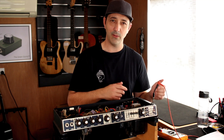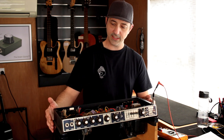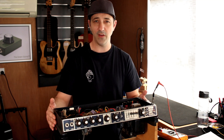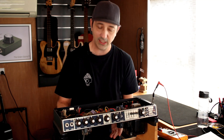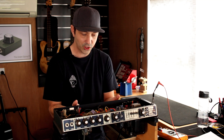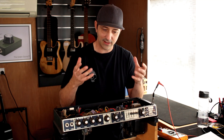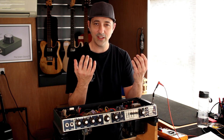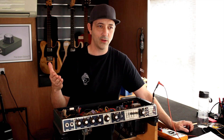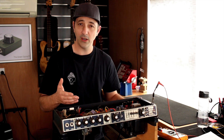You also want a clutter-free work area and something stable to rest your amp on. This is an amp chassis cradle that I made about 10 years ago — I've put hundreds of amps on it and it's ultra stable. If you want to put the amp directly on your bench onto the transformers, that's fine as long as the tubes aren't touching anything; just chock up the sides so it can't tip over. It has to be stable. Also, when pulling the chassis out of the shell, don't put your fingers up inside — grab the transformers and pull from there. You've constantly got to be thinking about the dangers involved.